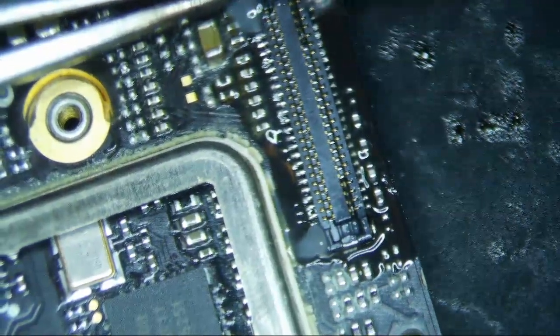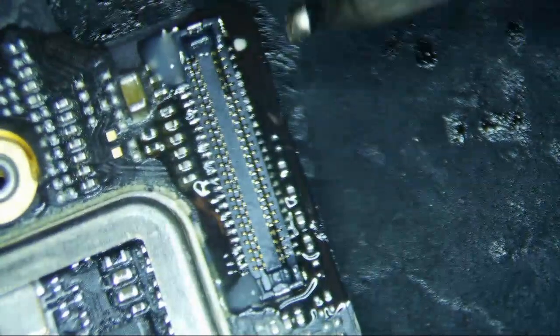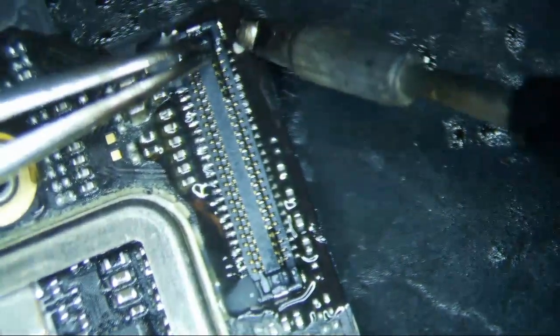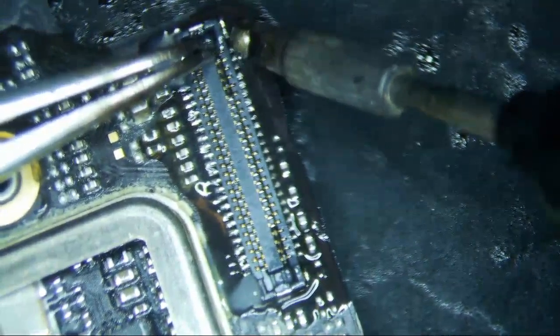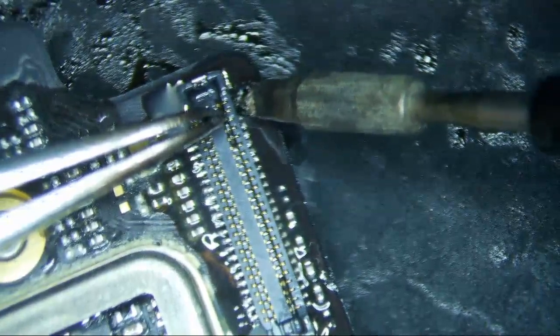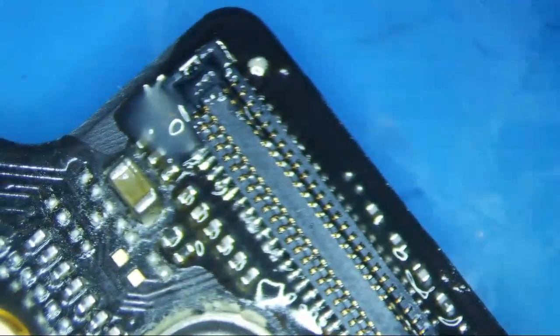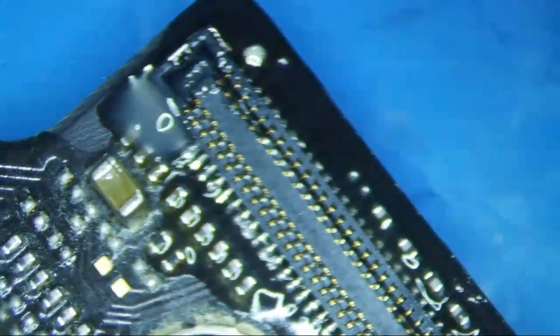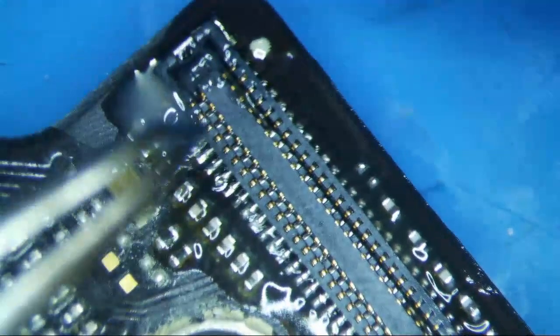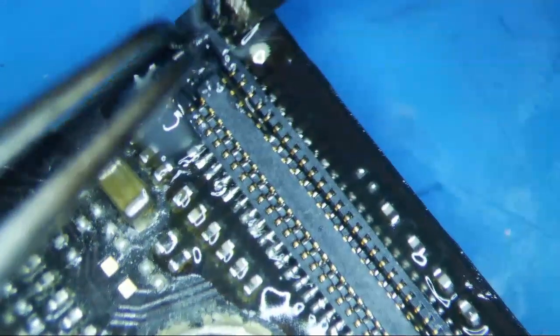I really like using this tip. It's not a new tip — I was using a knife tip before, but I think this is a C105113 tip on this JBC, and I actually like this better. I've had the same tip for almost a year now and it's going strong. Knife tips kind of go to crap after a little bit and you have to buy a new one. One thing that's really helped with tip life is lowering the temperature on my JBC. I'm at 300 degrees Celsius right now, but you can probably go down to about 290 and it really won't affect performance — and it prolongs the tip life.